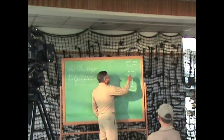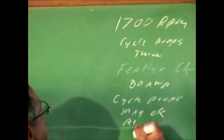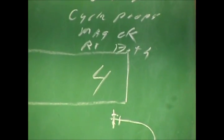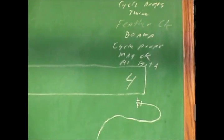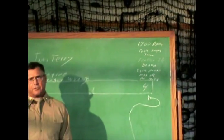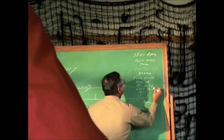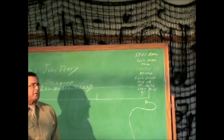So what we do is, at a higher engine setting, 1700 RPM, we go right, both, which means we just check the right mag, we turn the left mag off. I can't see the left engine from where I'm sitting on the right side, and you can't see the right engine. So when we're doing the mag check on the right engine, I'm looking at the engine and you're looking at the tachometer. So you're looking for a slight drop in the tachometer and I'm looking for a shake in the engine. So we go right, both, engine runs smooth again, then we go left, both, engine once again hopefully doesn't shake, RPM doesn't drop, engine runs smoothly, we go back to both.